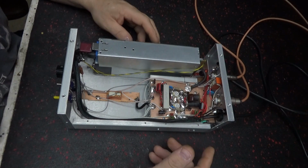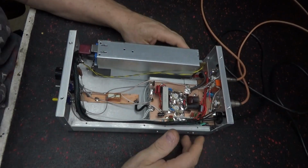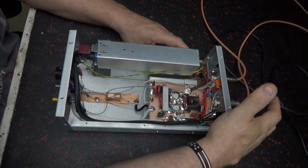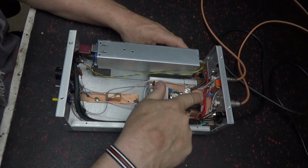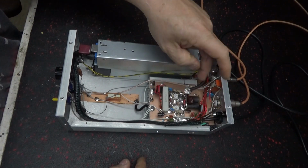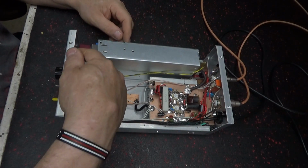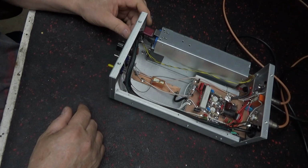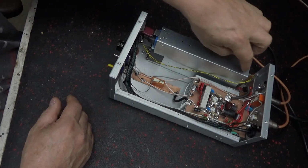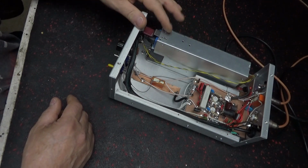But I like the way this little amp is. It's in a little small four-pill cabinet, and you could put 2879s in it. New tuning cap, new wire, run the hot and the ground over. The hot was run back out and around over there. New wire here to the switch, and it's switched now. I don't know why I didn't have the other one like that. This switch now turns the power supply on up here. The wires run back, the switch turns the power supply on.